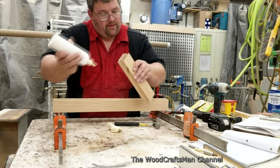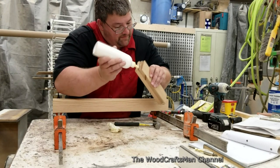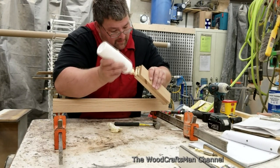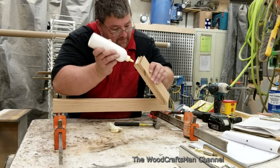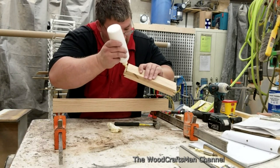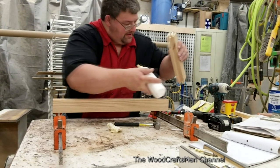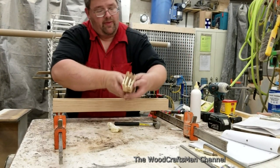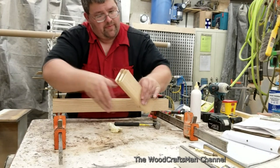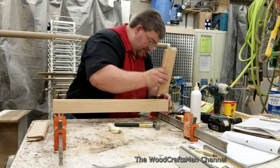And second of all, the panels are anywhere from an eighth inch to 3/16 away from the inside edge because of the space ball, so it's never an issue. But with these glass doors, I want to keep the corners nice and clean. The reason is the router bit that I would use to route out the back to create the rabbet is a solid carbide flush trimming bit used for plastic laminate trimming. If you've seen these before, you'd recognize them.